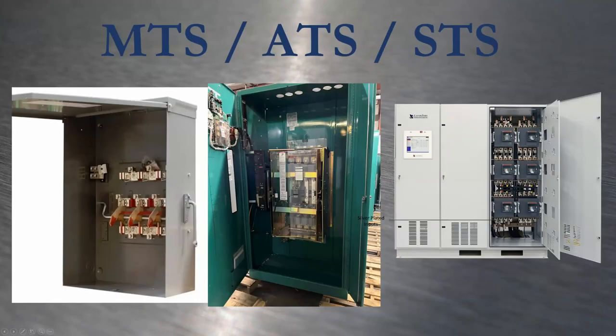Transfer switches are really cool. On the left you can see a manual transfer switch, or MTS. Say it's a small job site that has a backup generator and the power goes out — an operator can start the generator and manually throw the transfer switch to power the load off the backup source. An automatic transfer switch, or ATS, is the same thing in principle, but a controller can detect the loss of utility power, start the gen for you, and make the transfer after the gen is online. These are used extensively in large facilities, hospitals, military bases, or anywhere with life support equipment.